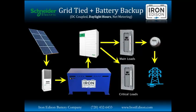What you see here is an example of what would be happening during typical daylight hours here in Colorado. The solar charging the battery through the MPPT charge controller. The energy will first go to power the critical loads. And then any excess solar production is going to be fed back upstream to the main load panel and then back out to the grid.